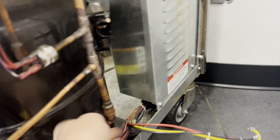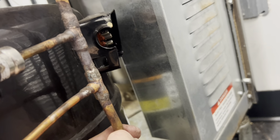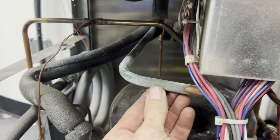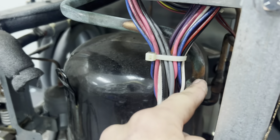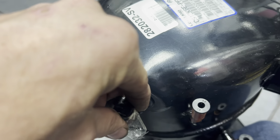We'll put a wet rag on everything. I contemplated just cutting the copper right there instead of unsweating things — it's always ideal if we can just cut and not unsweat. I thought about cutting the copper here and there, pulling the compressor out, and then using the old fitting as a model to make a new one just like it. That way we torch out here away from the wires.